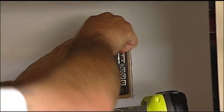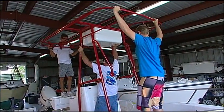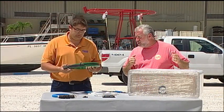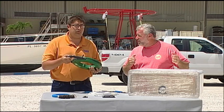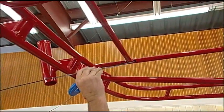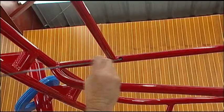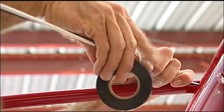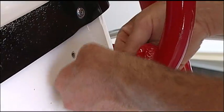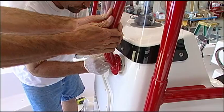Dominic, there are a lot of complicated curves and twists going into the frame of this T-top. What are we going to use fish-wise? We brought two different styles of fish that we like to use on boats: the first being a more flexible fiberglass style that allows you to make a lot of different curves on this T-top, and if you have straighter or shorter runs, the steel tape is actually easier to pull — it stays much sturdier and allows the wire to go along with it. The black cord is for future protection — if you already ran your wires but need to add something to your box or T-top later, you have something to pull from. You always want to leave a fish back behind if you ever need to add an accessory.